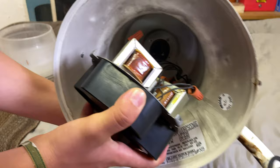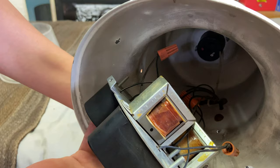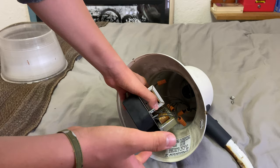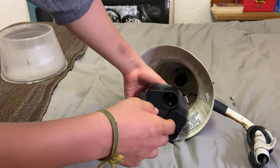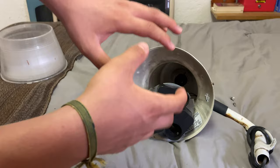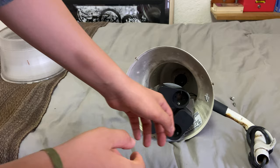So as you can see there, you have the twist and lock photocell socket. It was wired originally to the ballast, but now I just removed that because it's sometimes a little pain to turn the lamp on in your room, and then the photocell just gets triggered by the light of the lamp itself and turns off. So I just removed that and bypassed directly from the power.